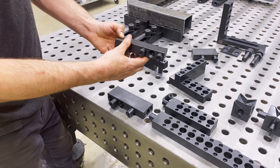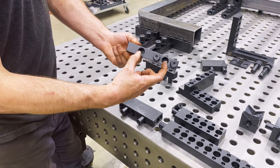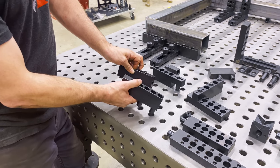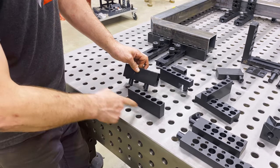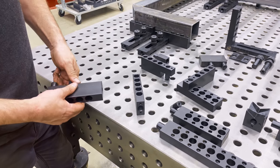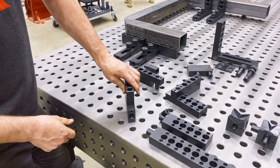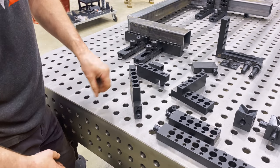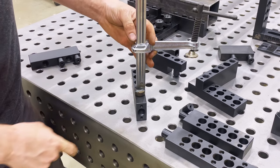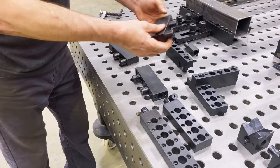Now this one is a little bit longer, which gives you more surface area to clamp to. The holes are in the bottom also, and this set of holes allows you to drop the pins in another location so that you can have a 90-degree or a parallel to the grid system, or you can go at a 45. Pretty simple. These holes in the top allow you to stack or add on top of the blocks to gain elevation, or to put a clamp in the top if you just run out of holes or need to span between hole to hole.